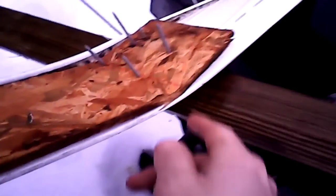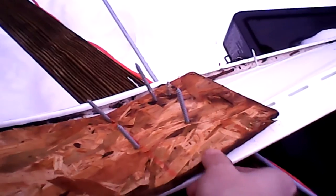I'm going to walk in here and say hi to Bethany. Most of what was hanging over there has already broke and fell. But you've got a big chunk of ice — the whole roof — and that's what shoved the pole. Right there is where your pole was sitting, and you can see where the chipboard was. That's why one of the screws didn't bite into anything — it's just chipboard, so one or two turns and the threads would just chew the hole out. I'll catch you later.